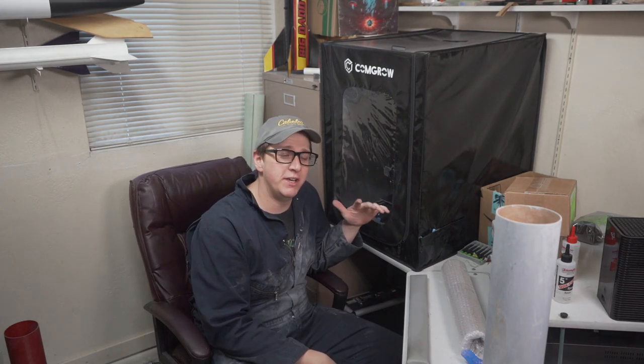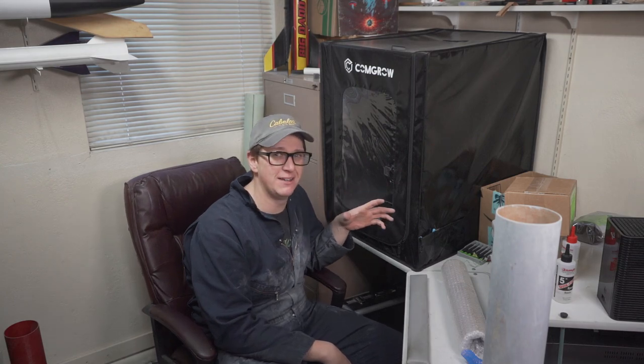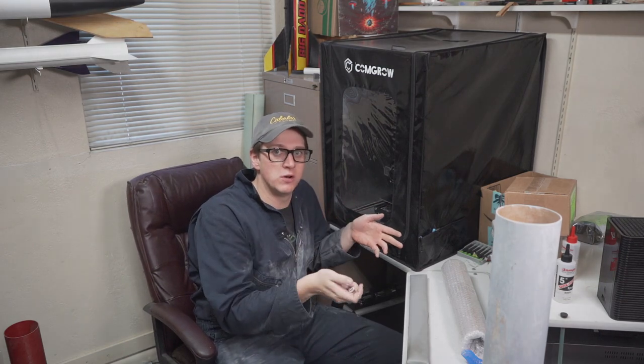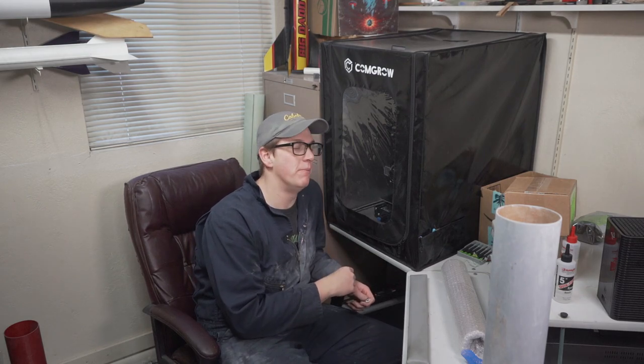A few people have asked about my 3D printer setup. It's the Ender 3 V2 with some basic modifications — the BL Touch auto-leveling system and custom firmware that lets you do manual override on the bed leveling. About every three months I change the nozzle, then meticulously level the bed with a piece of paper or using the BL Touch and manual override, and I do an auto level before every print. I also spray the bed with Aquanet every once in a while and clean it with rubbing alcohol.